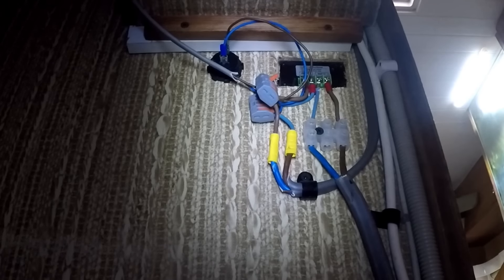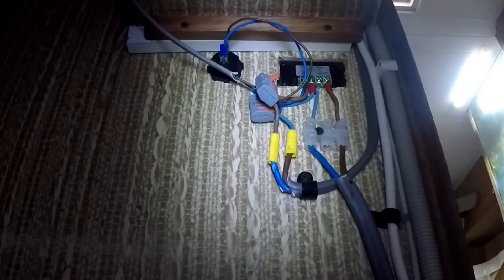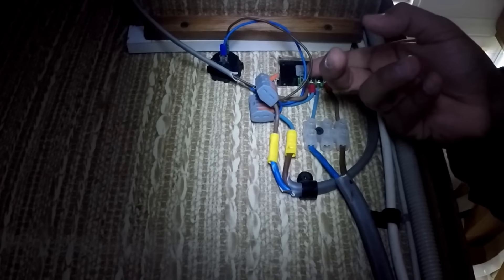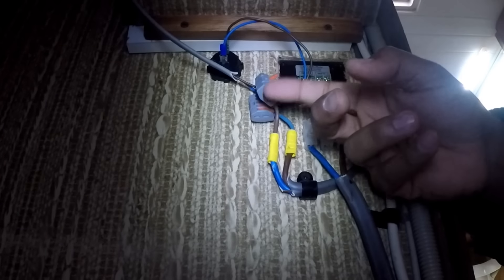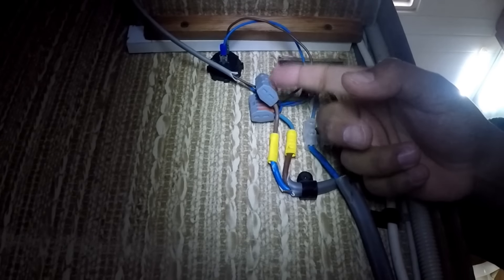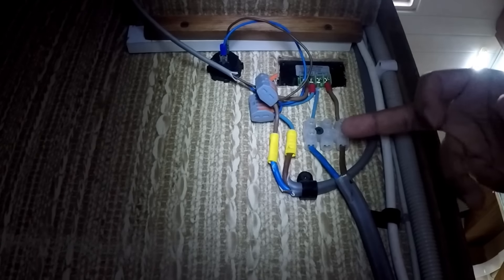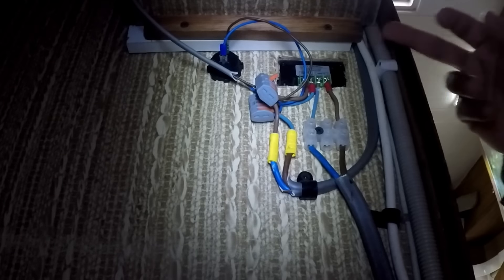This is how I wired it up. You've got your input that goes straight down to your battery. Your outputs — my zig box comes down into the output, and you've got your AC converter going into this block. Simple. Anything else you want to add, you can add it to your zig box or straight to these wire blocks — whatever you want to call them. You can buy these blocks and that's how simple it is.